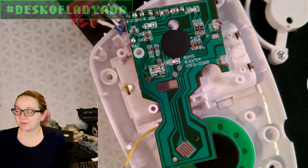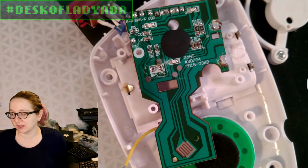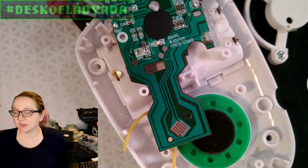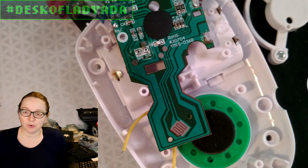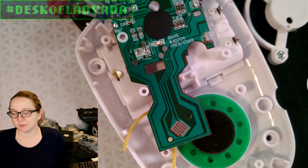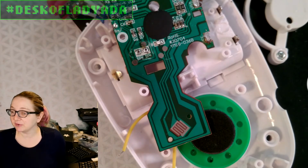Instead of fighting an 8-bit DAC on an ESP32, I was going to use I2S as an audio output because I wanted fairly good quality audio, and I wanted to drive the speaker directly. Historically, I've used the MAX98357, which is a very popular and wonderful I2S amplifier. It has only one weird detail: if you change the clock rate, sometimes it does a little pop on Raspberry Pi Linux, but otherwise it's a very good I2S amplifier. I was thinking of using that, but I thought maybe I would see if there are any other good options.